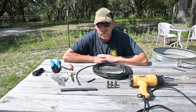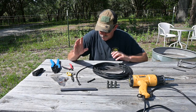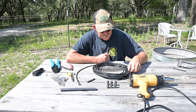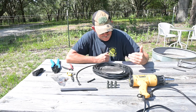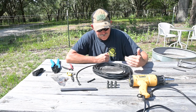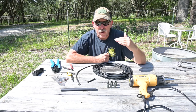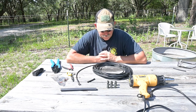This would be like RG58, or in this example we have RG223 because I happen to have a lot of that cable and I needed a 50 foot section with an integrated choke. End-fed antenna designs sometimes use the shield of the cable as a counterpoise, and you want to stop that common mode current from reaching your two-way radio equipment. In some designs you want to stop all of the common mode current at the antenna at the feed point, so either way this is a good way to do that.